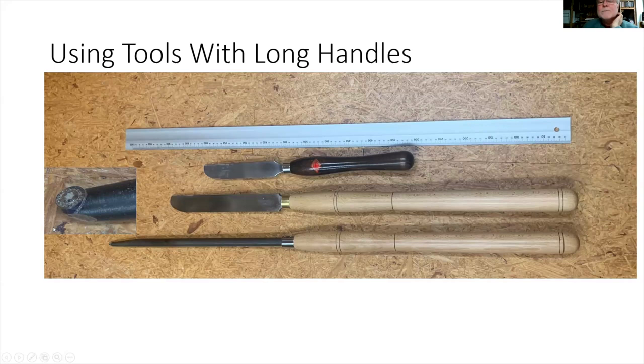I had mine out yesterday, that same cutter, and I wasn't very satisfied. I know the mate tool has a 22 degree angle, and I think that's pretty cool. But I still find it difficult to get a nice, smooth surface with a cutter that's small. So if you have the chance to get in with a scraper to clean it up later on, that improves the surface quality a lot.